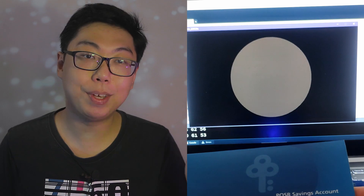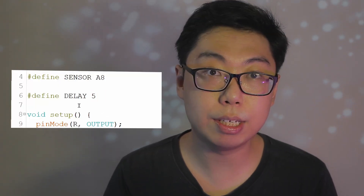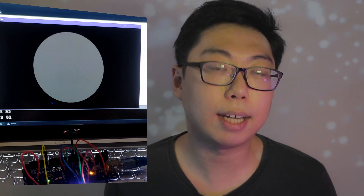As you can see, this has turned out not too bad. The color goes a little reddish once my hand goes over the sensor and back to a neutral gray when I pull it away. I went rummaging to find some colorful things and somehow came up with three disused books, coincidentally in red, green and blue — two bank books and yes, my passport. Holding each of these in front of the sensor, you can see a slight change in color, indicating that the sensor works, albeit not super well. Going back to the code, I tried playing around with the delay to see if the slow switching of colors was really necessary. To my surprise, it wasn't — even with a delay of just 5ms, where the flashing is not visible to the human eye, the program can still detect color without too much trouble.